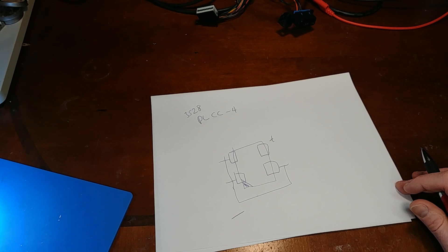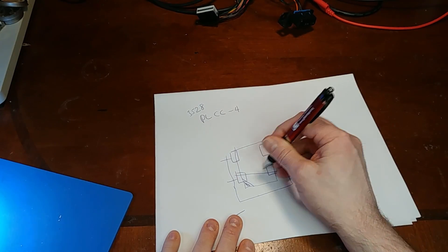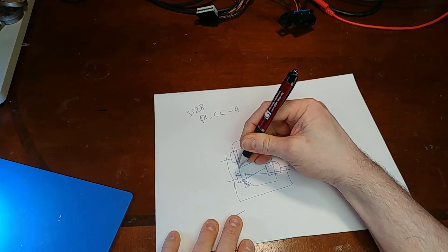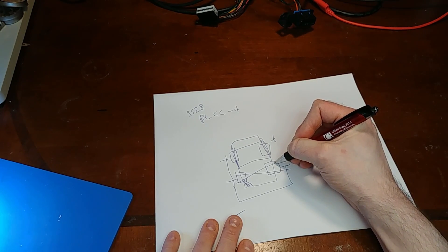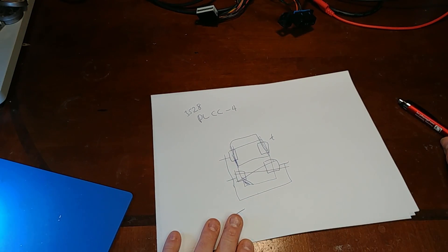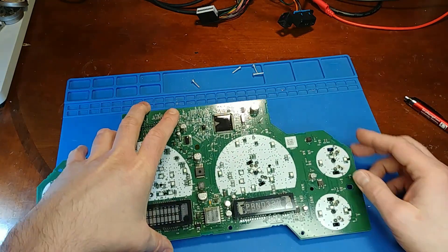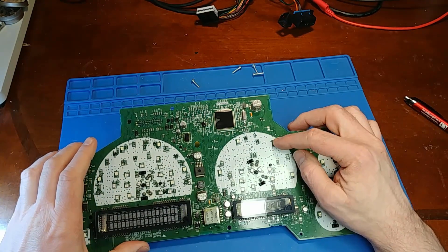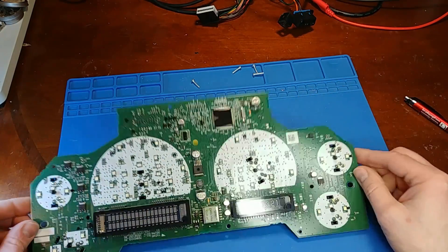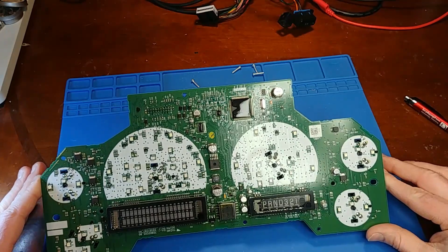What I'm going to be using is a more generic 3528 — a two-leaded 3528 — they're a little easier to come across. I'll place my LED here and use these two pads. The only thing to be careful of is that the little pad on the LED doesn't come down too far and make contact with the negative, because then you'll just make it short. I'm going to show two methods for removing these. Since they're four-leaded, they're a little trickier without hot air. I'll show removal with hot air and then with two soldering irons.